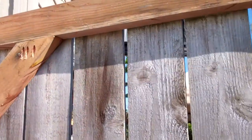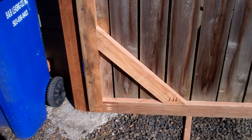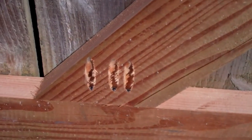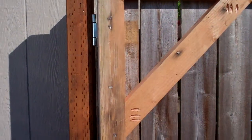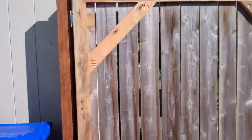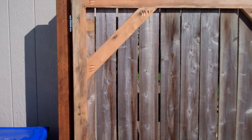So here's what it looks like, let's let it open all the way. I just built the frame and threw some 45s in there and Kreg jigged everything in. I did that all the way around and then put the new hinges in there and reused the slats. I think I'm into this 15 bucks for those heavy duty hinges with the big lag bolts.